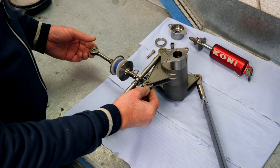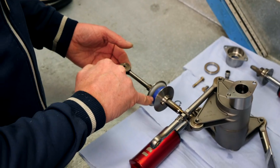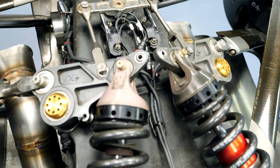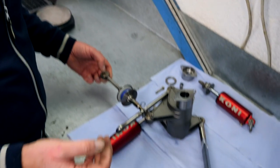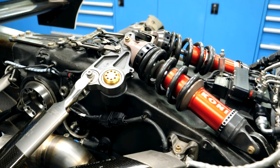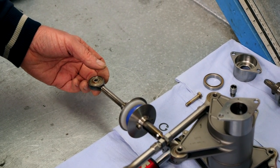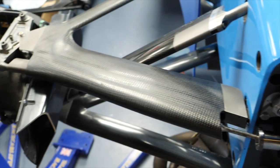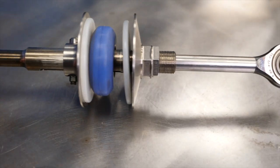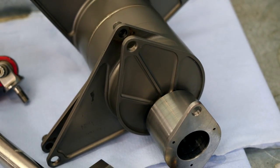This is the third damper, or pitch control. As the rocker rotates it pulls the third damper together and we start putting a load onto the bump rubber, which is available in a huge range of different loadings for compression — very high kilograms for small compression. On the other side there would essentially be the other rocker. When both sides go into compression — for example going down a straight with lots of aerodynamic force — it lowers the ride height and brings this bump rubber, essentially a ring of rubber, together. It acts as a spring for fine control and keeping the car off the road.